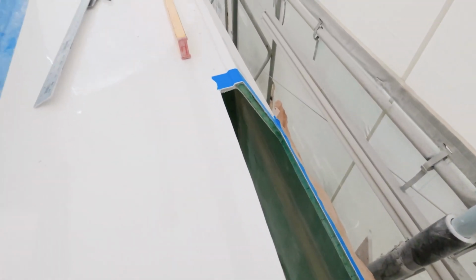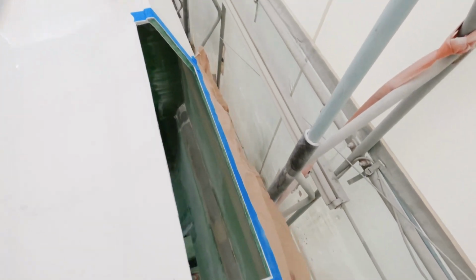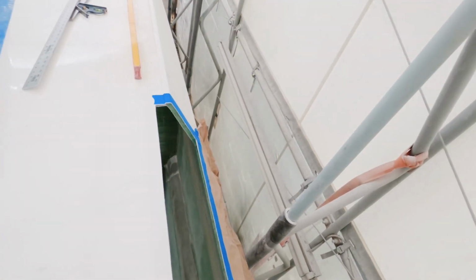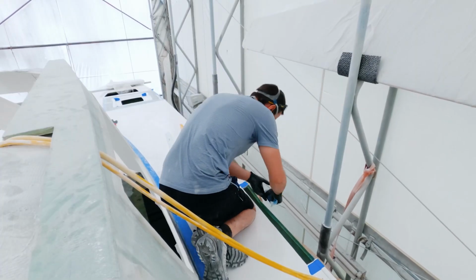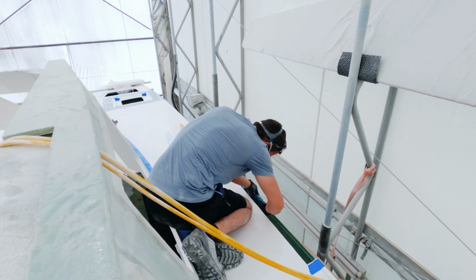Okay, so I decored now roughly a half an inch, top and bottom, of course, through the hull. And I will just be filling that in with thickened resin, which will actually have some chopped strand in it as well.